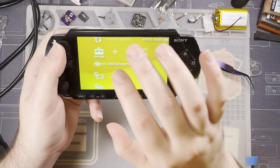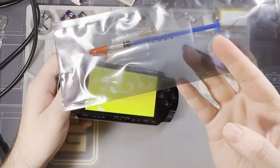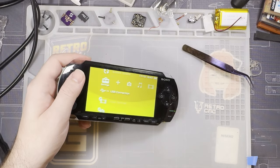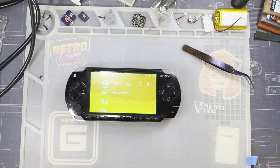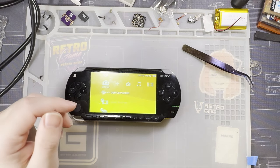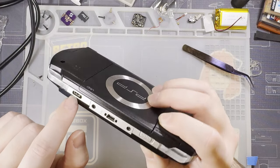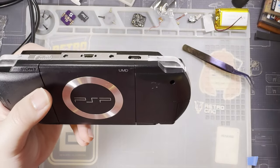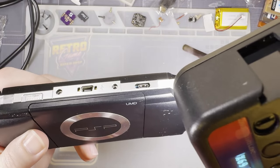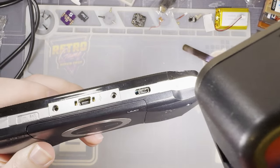So I guess if you've already got one of these kits, well, that's a relatively easy fix. Definitely not happening with this nonsense, but if you're comfortable soldering to a 0.5 millimeter pitch flat flex cable, then the fix is pretty easy. Just insulating that port was all that I needed on here. Probably hard to see in there, but you could see that blue painter's tape right on the motherboard that port is resting up against.